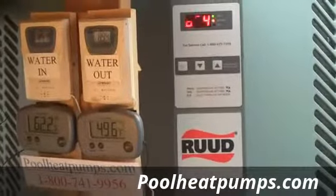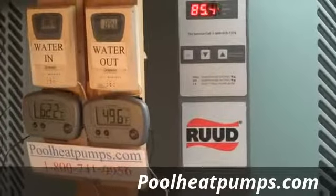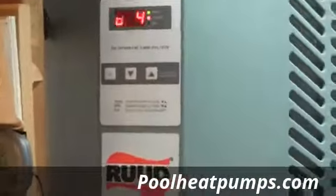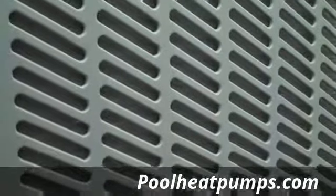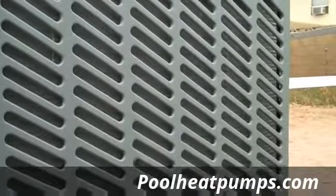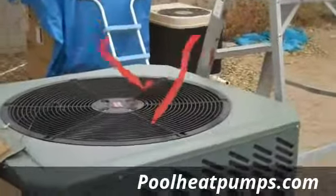In these conditions with 62-degree air, I'm getting about 85,000 BTUs based on my gallons per minute through the pump. If it got up into the upper 70s and 80s, I'd be getting the full 104,000 or more. When it gets really cold down into the 40s and 30s at night, this unit still works really well because it has a power defrost built in — a special feature of the heat and cool model. The evaporator coil can start to build up ice in cold temperatures, and the heater will automatically detect this and for about three to four minutes defrost that ice off quickly, then continue running and heating the pool. This allows it to cycle in and out of defrost instead of permanently shutting off for the night like most heat pumps do.